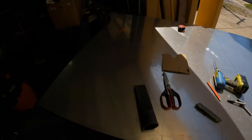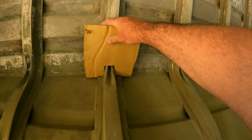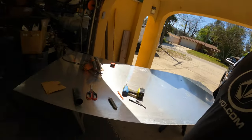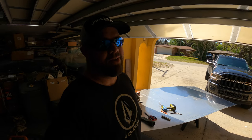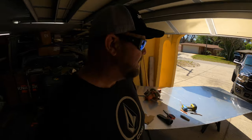I have a five-foot by ten-foot piece of eighth-inch aluminum. I've marked it out already on the ribs and we're going to start cutting it here in a second. I also took a piece of cardboard and made a jig of the actual rib I'm working with, that way I can trace them out and cut it all out. This is very critical - you ever hear the saying 'a good carpenter measures twice, cuts once'? You can't make metal again. So I will double and triple check the measurements before we do any cutting. Main thing when cutting aluminum with a skill saw - you need eye protection. Don't ask me how I know so well, because I've had a couple trips to the ER. Definitely have good eye protection on.